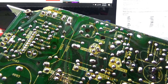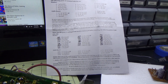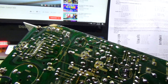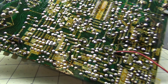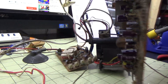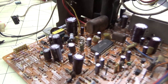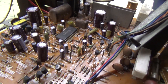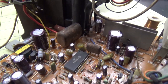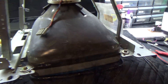All right, the cap kit is fully installed. Here's my list — as I finished each one I marked it off, just finished up that last bipolar cap. I also went ahead and reflowed the flyback and everything else that looked dry. Now we're going to reassemble the chassis into the frame. You can see all the new caps on the top — I'm going to clean up the board with some contact cleaner and put new ties around the coil on the monitor.